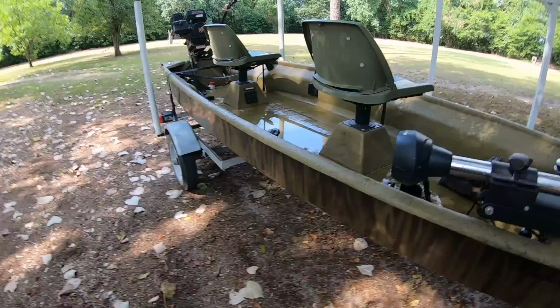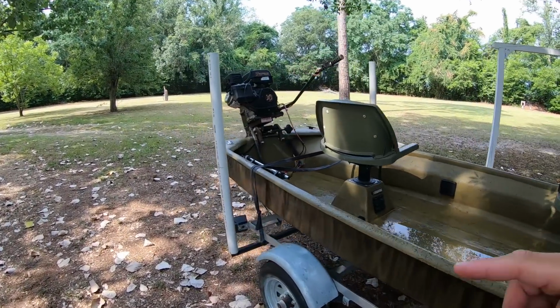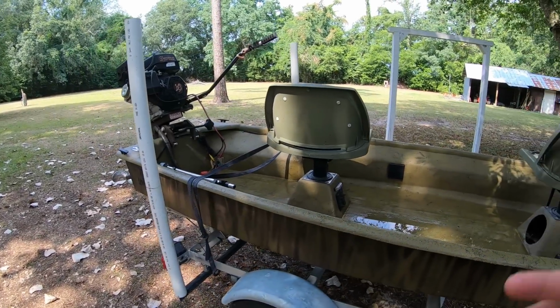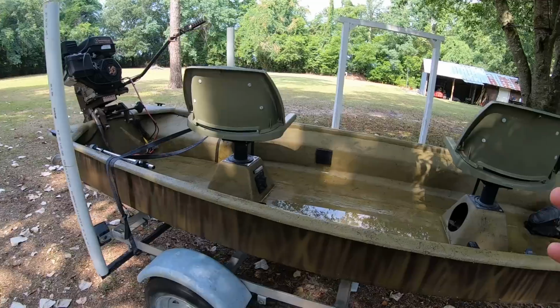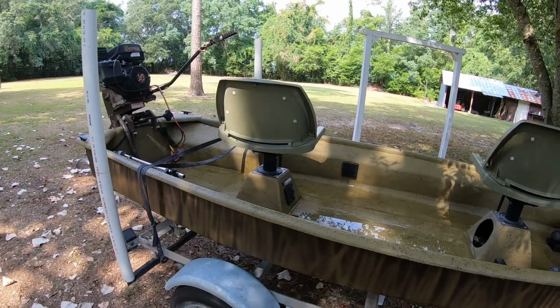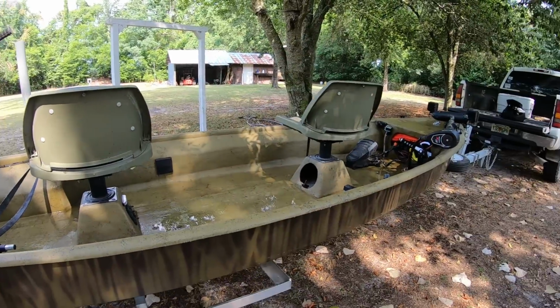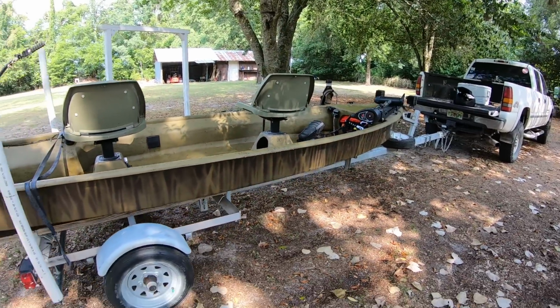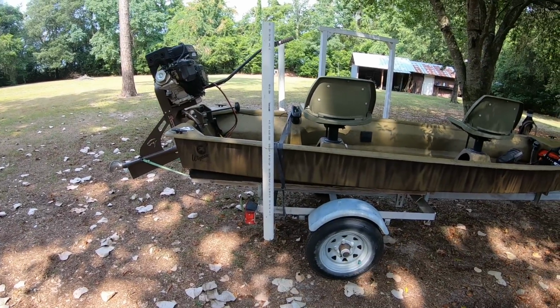And by the way, pretty important with these mud motors, all those speeds that I just gave you, that's in deeper water. The shallower the water, the faster the boat runs, but I'm typically running rivers and a little bit deeper lakes, you know, things 4, 5, 10 foot deep, not the 1 foot or less that kind of gives you a little lift and speeds you up as well. So it may run even faster than what I just quoted you, depending on where you're gonna run it.